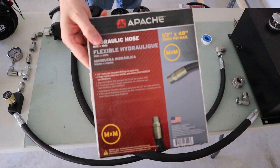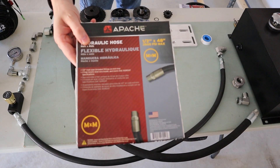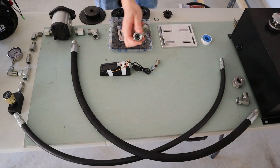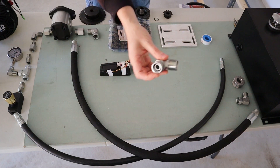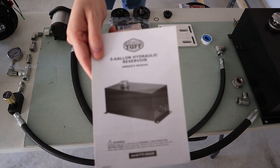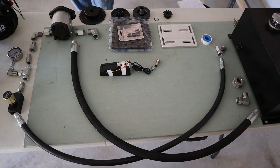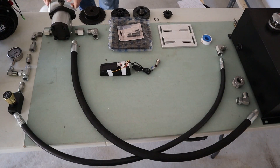My first hydraulic hose is a higher pressure-rated hydraulic hose — 1/2-inch and 48 inches long — to be able to put it onto the frame. Coming off of the hose, I have a 1/2-inch female swivel going to a 3/4-inch male. The 3/4-inch fitting goes into the tank, which is just a 5-gallon hydraulic reservoir. You can save some money if you don't want to go with the tank — if you have an old propane tank, you can actually weld a couple of fittings on there.